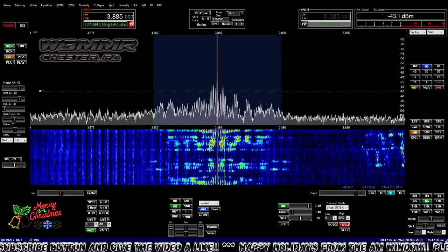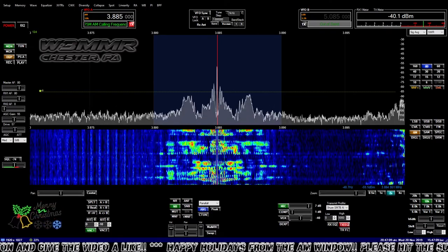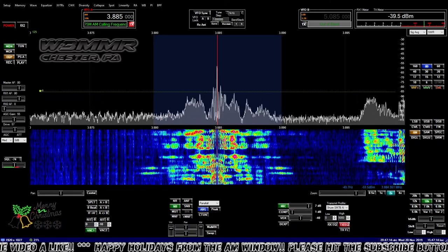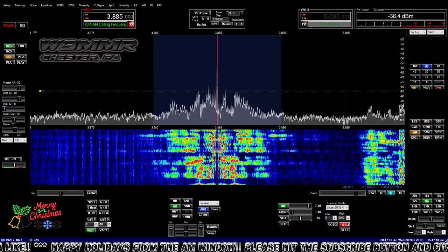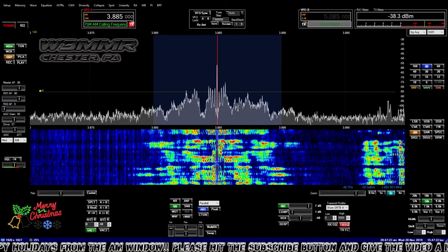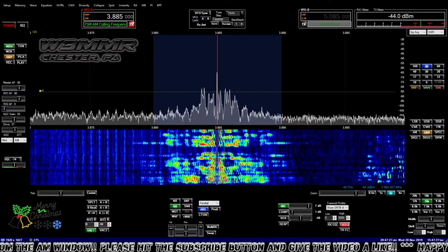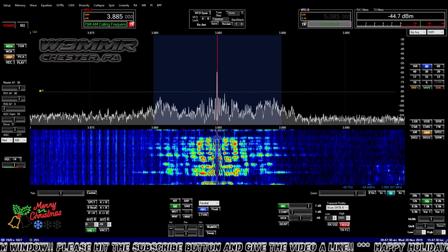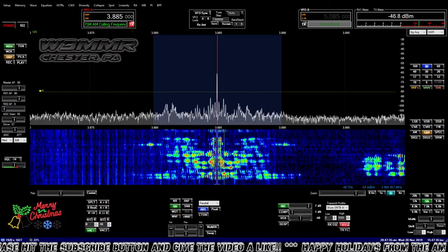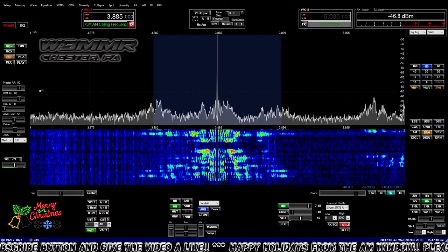The really big thing was when you get the currents correct due to the propagation of the feed lines, it ends up improving the pattern. Dave in the UK was saying he kept consistently seeing 25 dB, which is absurd, and I got that report from a number of stations in Europe. I must have been lucky in one respect because the ground coupling is also a huge part of the array, and being up 50 to 60 feet just happens to match the correct height above ground for the phase angles I've chosen.